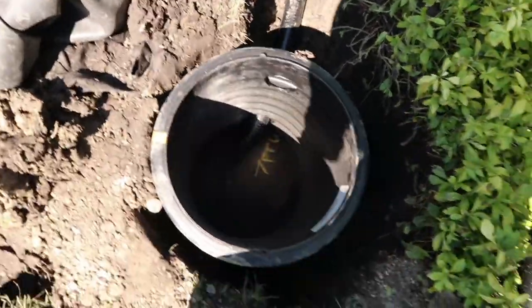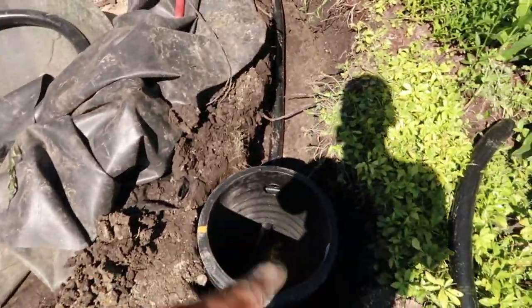We can get sometimes negative 20, negative 30 below with wind chill, but that frost line can go down pretty far, and being that this pipe is buried only about a foot below grade, we want to ensure that that pipe never freezes with water in it and cracks — because that would suck to come back and fix. We're probably going to have to blow out these lines because gravity will not completely empty that line into the skimmer when we undo the check valve.